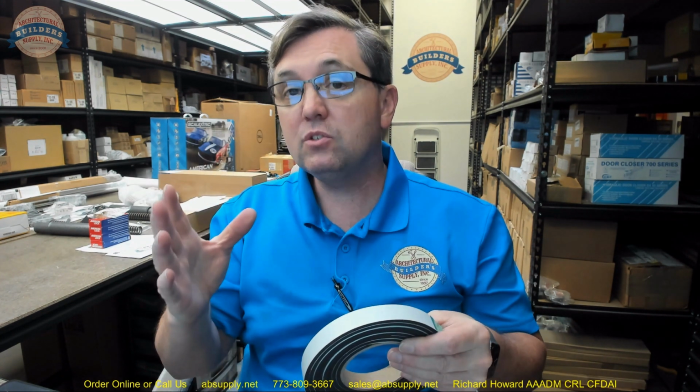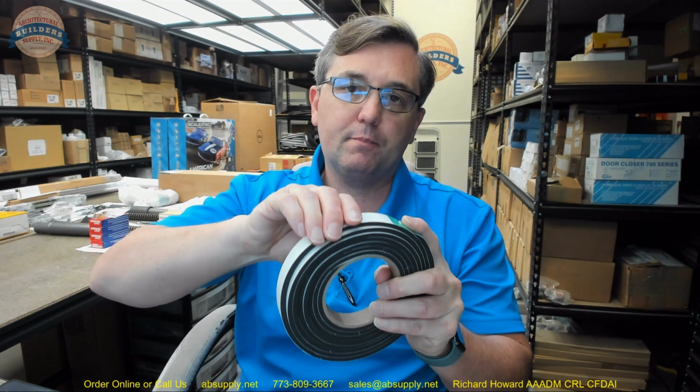This is a sponge neoprene, and it wasn't necessarily the best for my application, but I wanted it for its shock absorbing as well. Sponge neoprene would not be necessarily great for direct water hitting it. It's a sponge, full of tiny air pockets. It will be good for sound attenuation. Closed cell neoprene, which smells like car tire rubber, would be best for water intrusion, but the fact of the matter is we're not going to get closed cell neoprene in all these options, even though we could probably get something.